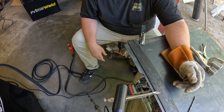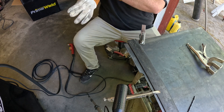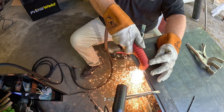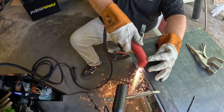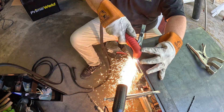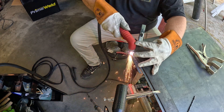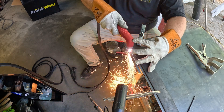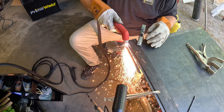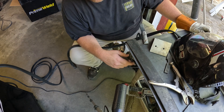We were at 30 amps last time. Going to increase to 35 amps and keep the PSI at about 40. Let's see how it does now.